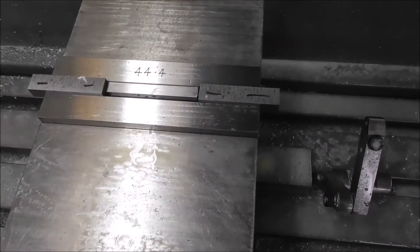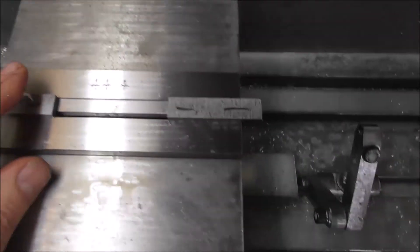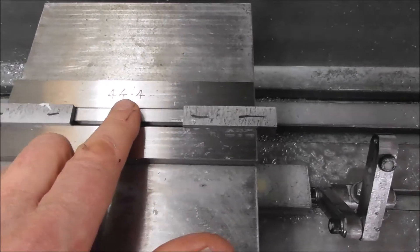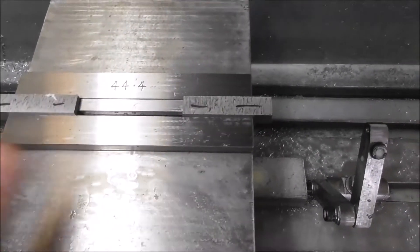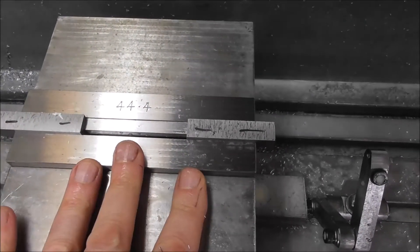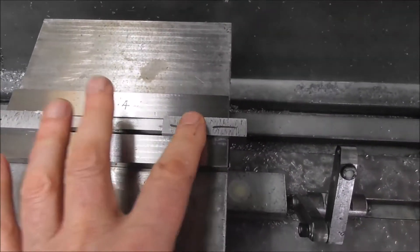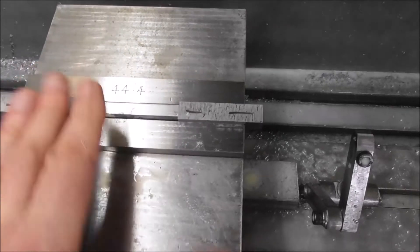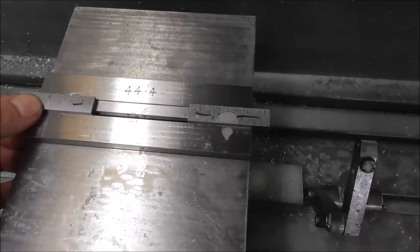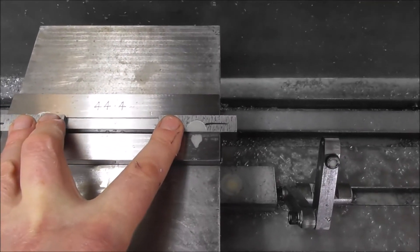You should always do two at a time wherever possible. You can set them central on that central gauge block which is instant-glued onto the jaws - you can remove it later by tapping it off and stoning off the glue. It's a very good way to balance the vice so the jaw floats and holds both parts evenly. You don't get jaw racking with its accuracy, safety, and reliability issues.